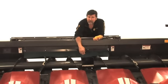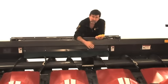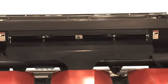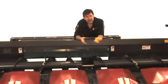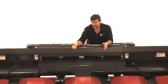Instead of a 90-degree angle, we're going to attach it in a tangent position, and as that paddle goes around, it bends back as it starts to incorporate the corn. When it's bending back, it's storing energy. When it gets to the feeder house opening, it releases that energy and pushes that ear corn in. It actually starts to try to force feed that feeder house when that feeder house doesn't want to take the corn away.